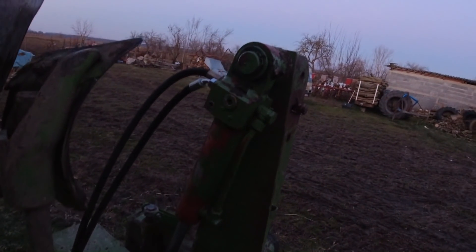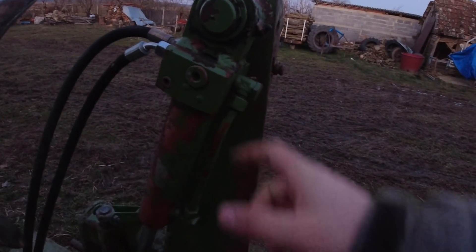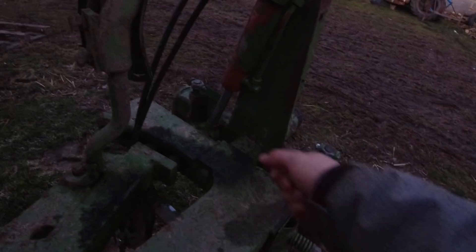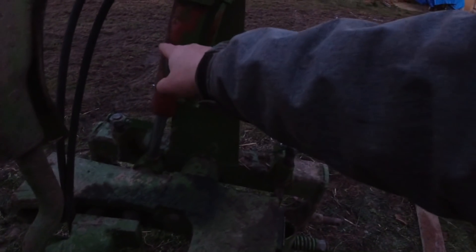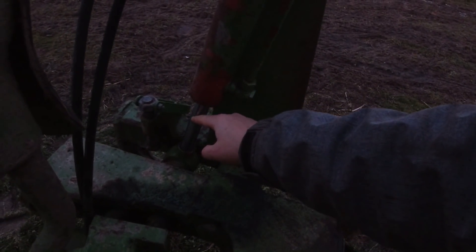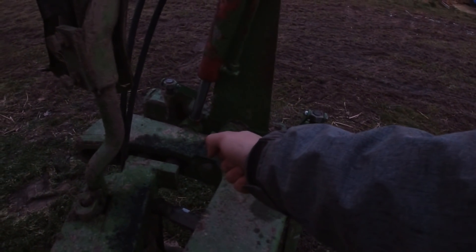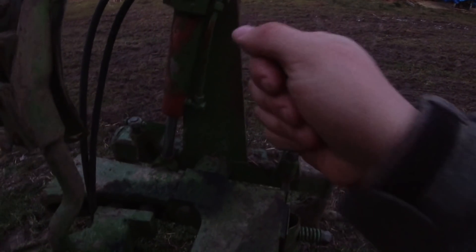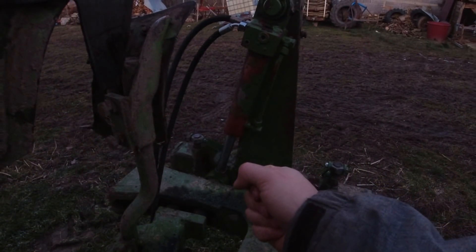As for turning, this plow has a double-acting cylinder, and it has this thing that everyone calls the 'cube.' That cube changes the direction of the oil. So when I lift the plow and I'm turning, I pull the hydraulic lever to one side — the cylinder retracts — and when it reaches the top, meaning when the plow reaches balance, the cube automatically changes direction so the piston extends. But I hold the lever in one direction the whole time. So I don't need to pull the lever one way to retract the cylinder and then when the plow flips over, push it the other way to extend it — the cube handles the oil direction change, and I just hold the lever in one position the whole time.